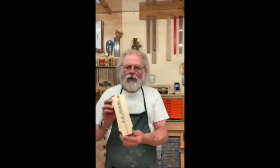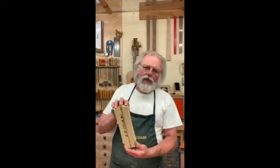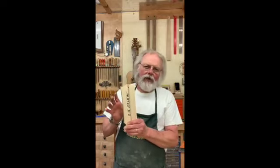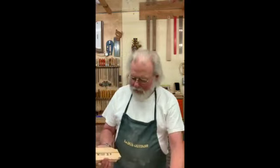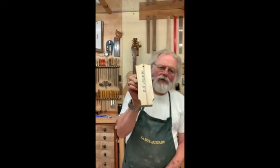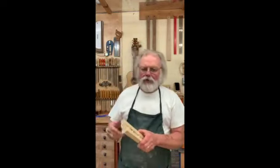And it's also important that every time you build a different style of instrument or a different neck width, you may want to change the profile of your headpiece, or you may want to alter its size ever so slightly. A very large headpiece, for example, like this one, might look really out of place on a small bodied guitar like a double O or similar size, or worse yet, a parlor. So I have a lot of different templates for these purposes. And the other consideration is that this portion right here must match the zero end of the headpiece. And so lots of templates, at least for my purposes, come in very handy.